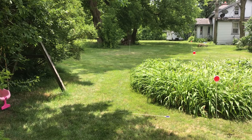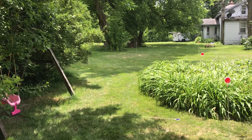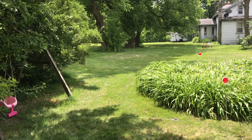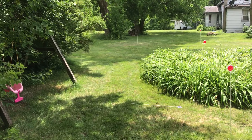Since we are going to do a heated slab, we have to put that foam down so we're not heating the earth versus keeping that heat in the garage and heating the garage itself. So overall, I'm pretty lucky here from a grade standpoint, fairly level. I won't have to bring in fill at all, I don't think.